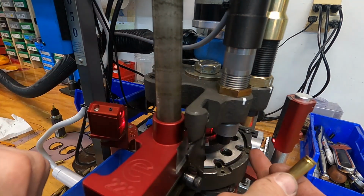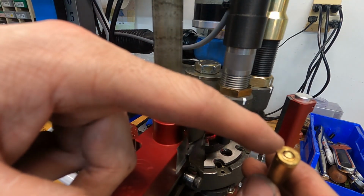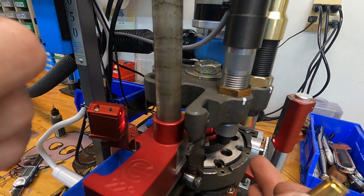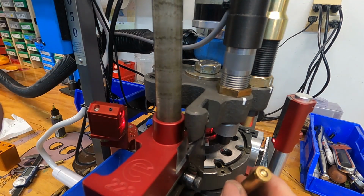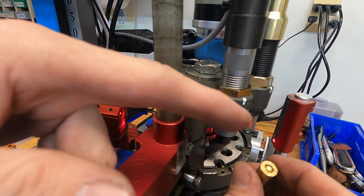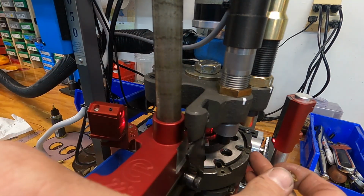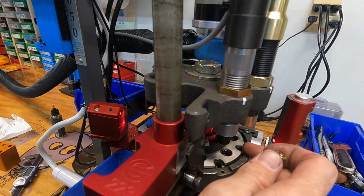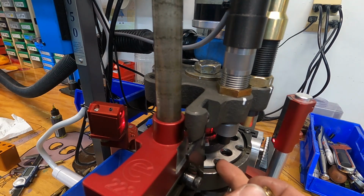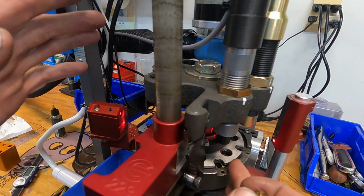So on the 1050, it would go next to your swage station. And hopefully you got your sensors and everything turned on. You got to swage it, or your swage sensor on. It would catch it. But these are the problems you want to catch before you damage something like this. I mean, if you damage this swage rod, that's a lot more money than replacing a pin or something like that.